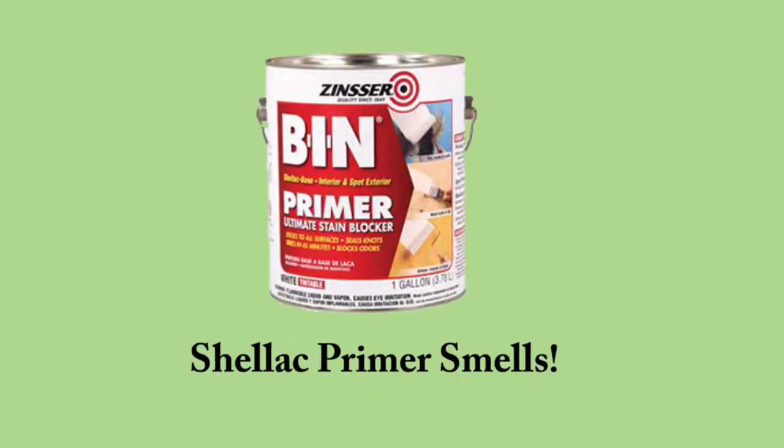However, there is a downside to the shellac primer, and that is it has a very pungent odor. And if you're working in an office, this shellac primer won't be a good fit for you. If there's someone who's pregnant or any kind of health reasons, shellac primer might not be the best product to use. Instead, a backup, a distant second in my opinion, would be a latex primer, Extreme Bond or Stix.